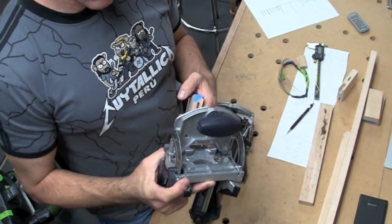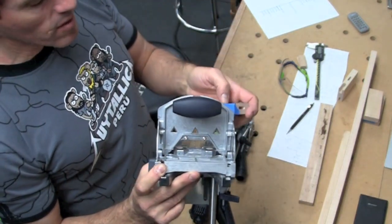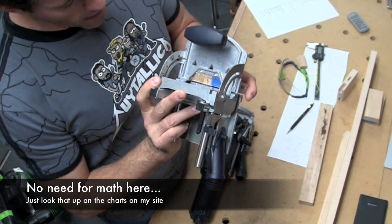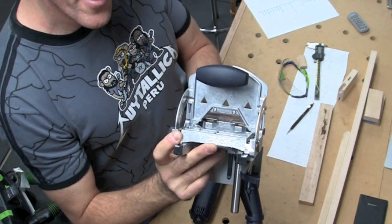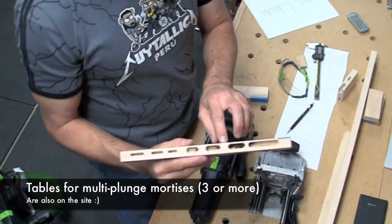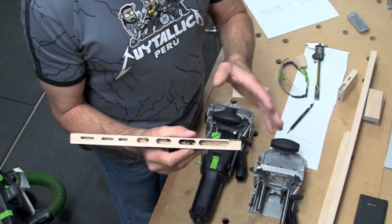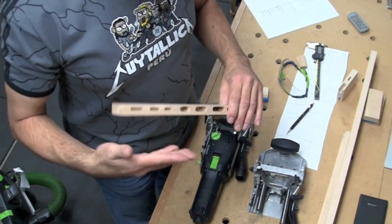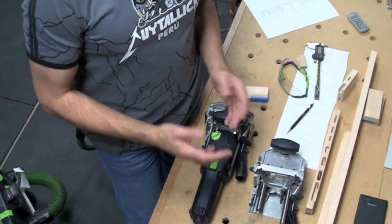You don't have to use a 13mm line — you could use the 10mm line, which is the smallest registered on the cursors. If you use the 10mm offset, you'd be making a 52mm wide mortise. You can go wider using lines further out, but then you won't get a clean mortise in those two passes — you'd end up with a section in between the mortises and would have to go back and plow out the middle. There's no real measurement for that; you can just scoot over and take care of it in a very easy cleanup pass. You can use these formulas to extend out even further for a larger mortise, then just create the tenons to go with it.